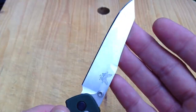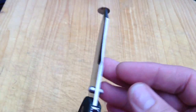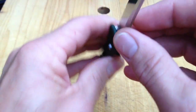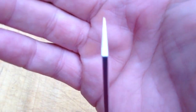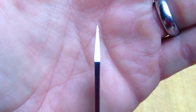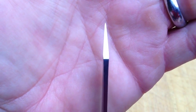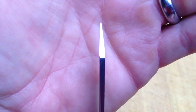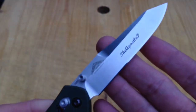This one came to me down around ten thousandths. Which, because of the main grind profile of the knife — let me show you the point to get an idea of what I'm talking about here. The main grind of the knife is about 10 to 12 degrees inclusive. So it's essentially a wedge. And a lot of guys have problems making it cut. So I wanted them to send me the blade that I could make into the best cutter possible.